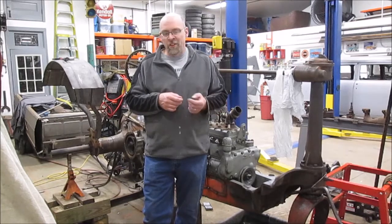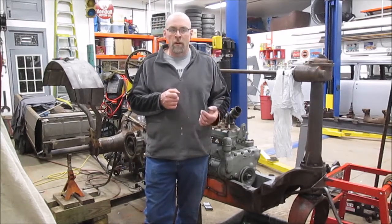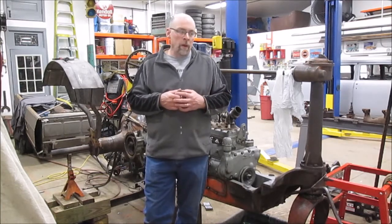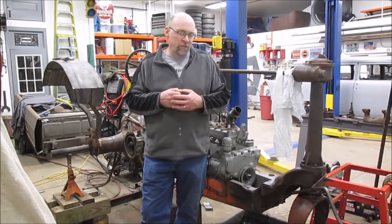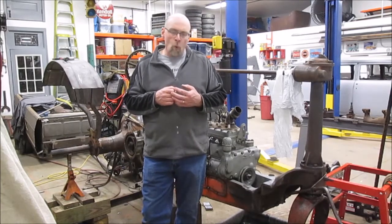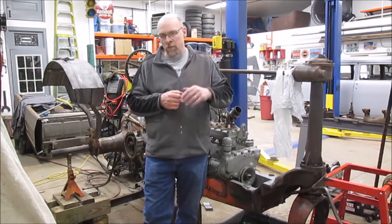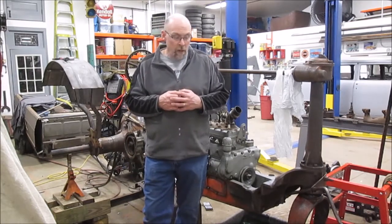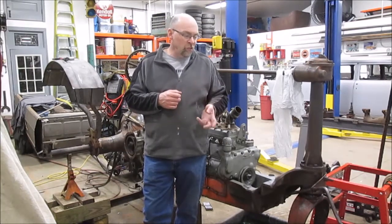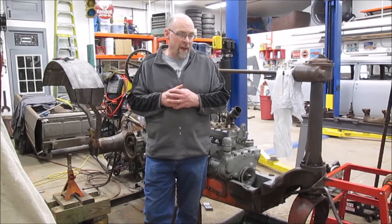He put a 5/16 bolt in it. The hole is between 5/16 and 3/8, so using another bolt of that size wouldn't work. I looked around my collection of steel, didn't find anything, and finally I said, Dad, I've got some old grade 8 bolts here that are a little larger. Let's use one for steel stock, turn it down, and make a pin. So that's what he and I did real quick on the lathe and installed it in the crank. And it looks like everything's going to work well there now.